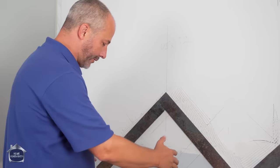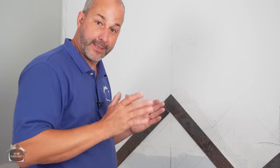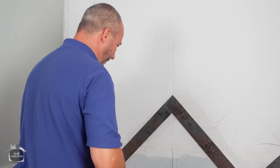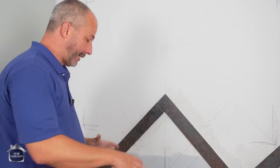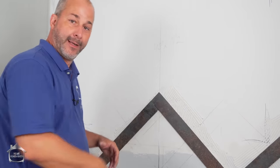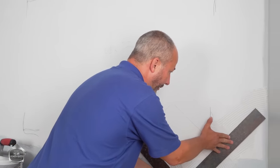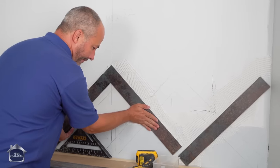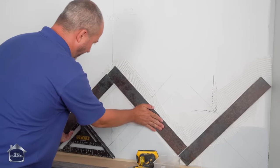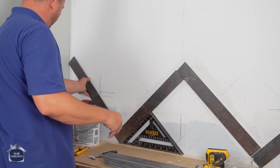Depending on the situation, if you have a traditional sink and a center faucet, and you offset this a little bit, you're going to run into a design issue where it's going to look silly having all of the peaks to the side of the faucet. Like, you can just imagine if your faucet's here and it's all off an inch. Okay, it might look silly. But for me, because I'm using a stone sink and my faucet's already offset, my mirror's so huge, I really don't have a center line issue to deal with. So what I'm going to do is I'm going to actually send that over off the wall, and I'm going to reposition all of my tile so that I can finish wall to wall centered with a full stone over here as well. Wow, that's going to be amazing.